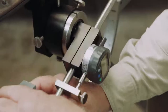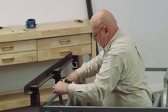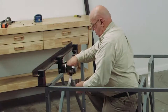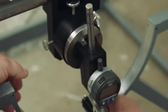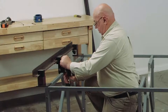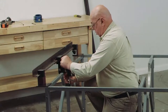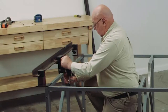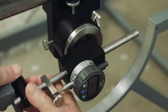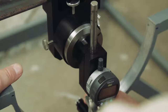I zero the reading. Now what I'm doing up and down — I want to take it right to zero. Many times you'll be setting up to what they call the oil slinger or the seal, so they'll measure that to the rotor and it'll be an offset. You'll want to set this up to the offsets that they give you, not zeros. Once I have zero, zero, and zero, I have the holder set to the bore.